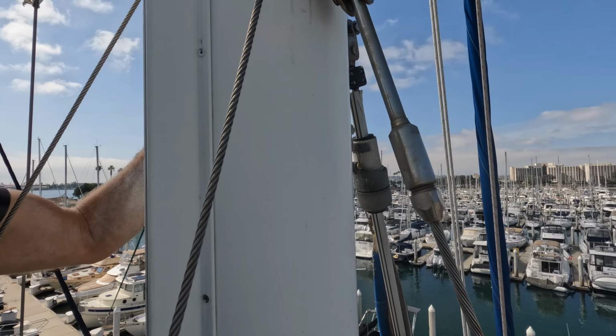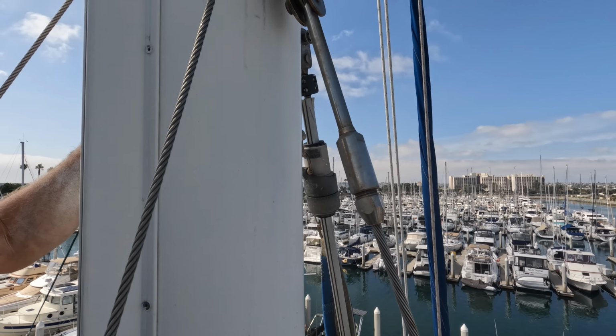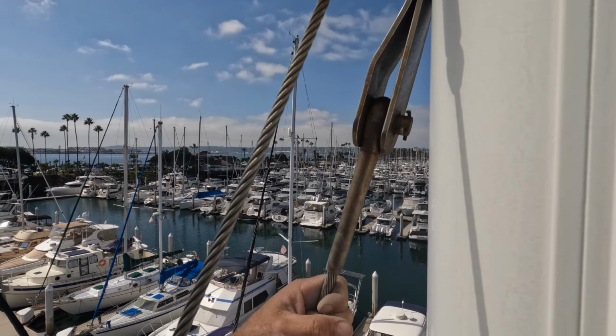We'll keep looking. There's definitely certain parts of the rig that have been changed. As you can see here, there is a stay lock fitting, and then over here there is a swage fitting. I'm assuming by the look of the swage fittings, maybe they were just slowly in the process of turning it all over to stay lock. Not sure how I'm going to decipher all this. I haven't found any notes on the rigging yet.